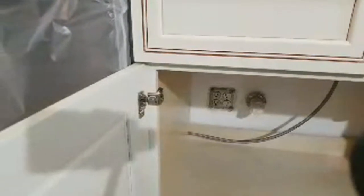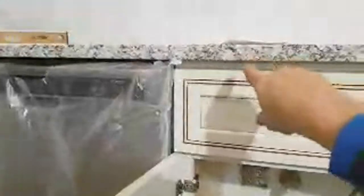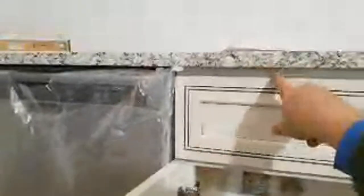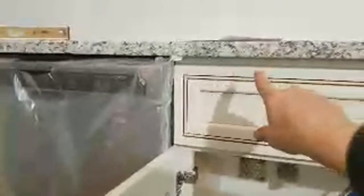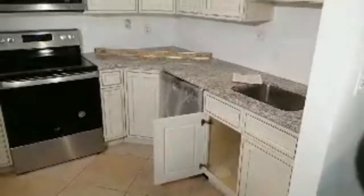Yeah, that's one they usually fix along with the dishwasher drain hose not being plumbed correctly. And some states like Wisconsin don't even allow you to do the high loop up to the counter. Theirs is really stupid. Up there, you have to run it to something called an air gap, and this air gap sits above the counter like a freaking ugly cell phone tower or something. That's the way Wisconsin wants you to do those air gaps.